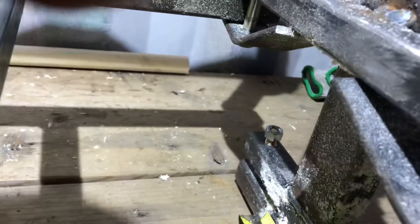Down here is the same flat bar — this is what you use to pinch your bar. They're a little too wide; about two inches long would be plenty for that flat bar. There's another video that shows me building this, so you can go watch that if you want more detail, but this video is just to give you the dimensions.